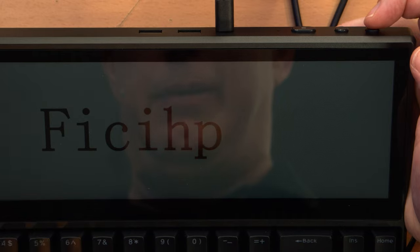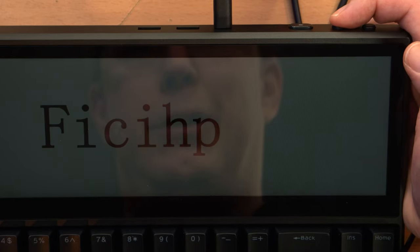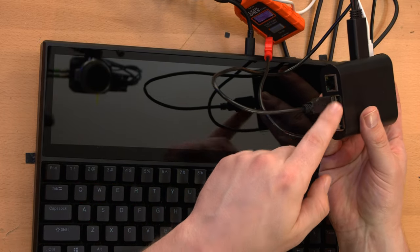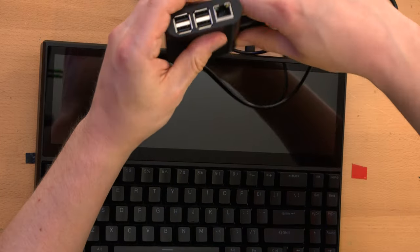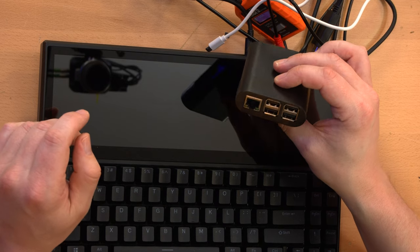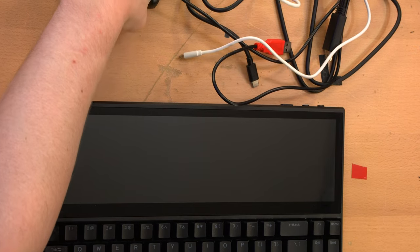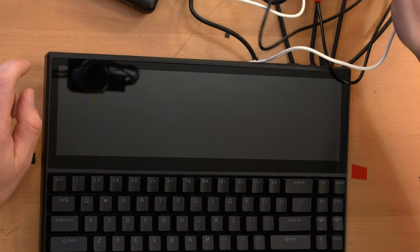As we raise the backlight — I barely got the backlight up at all and it just reset the device. It's definitely drawing too much current. The poor little Raspberry Pi is limited to just a little over 500 milliamps, maybe 600 milliamps on its USB port. And if you have more than one device connected, it's probably a shared power rail. I think this is a Raspberry Pi 3B+. Newer Pi versions may support higher USB current. If you're planning on using it with the Raspberry Pi, you will need an external power supply, and possibly an OS that natively supports 1920 by 515.